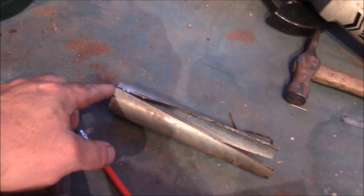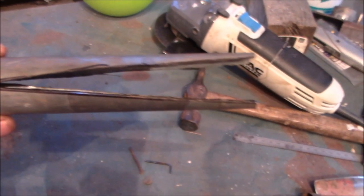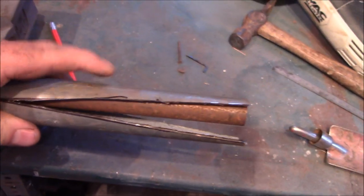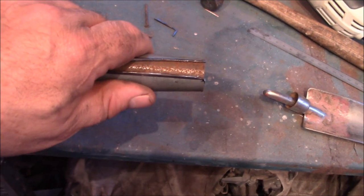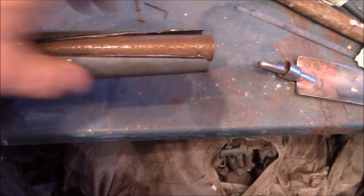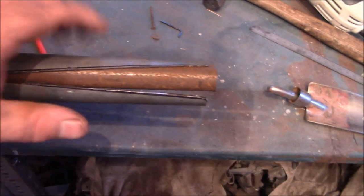I've just cut it off - I kept the full pipe so I could hold it in the vise while cutting. Now you can see that's basically going to be the handle. What I need to do is make this end more rounded. I'll put this bar in the vise, hold it there, and tap down on this surface, then turn it round and tap down on each surface in turn, to start bringing the two pieces together into the rounded handle. You can see what it's going to look like - bigger at that end, smaller at that end - and then I can weld the two edges together all the way up, forming the conical shape.